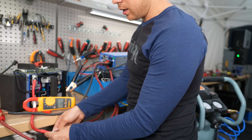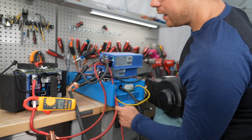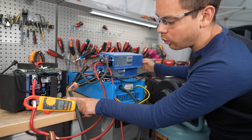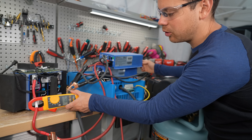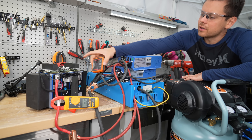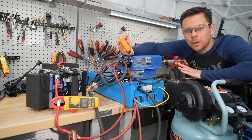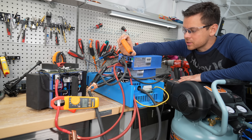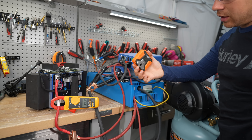I'm pretty impatient so we're going to add another charger. We're now pulling 88 amps, then 101, 102, 99 amps. Let's see how long it can hold this. So far so good — the heat camera shows only 95 degrees Fahrenheit on the supply conductors and everything else is staying relatively cool. Coming back a few minutes later, we're at about 105 and it's not increasing, so I think it's pretty good.